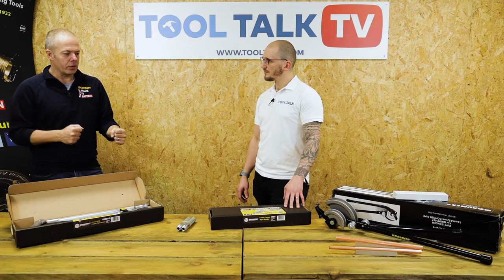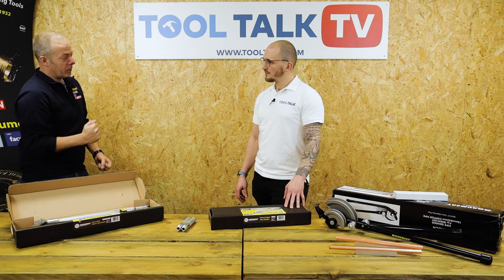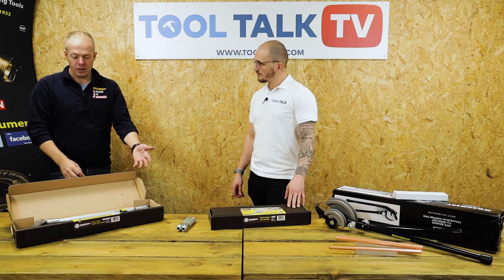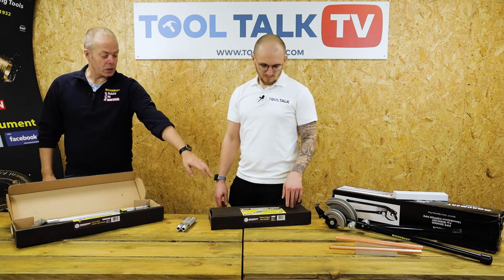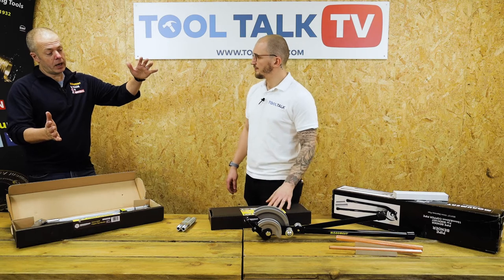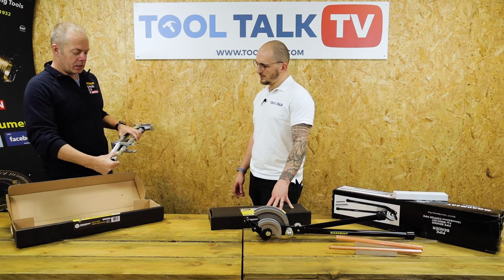When it comes to 22, you need quite a lot of oomph. One of the reasons that on a traditional combi bender and on these is you would have a rubber foot so you could put the bender on the floor and then bend it like that, because you just need that leverage — some additional leverage just to get the bend started. You can bend it without the extension handles, and I got to a point where I could comfortably do it. But some people just want a little bit of extra leverage. The extension handles are interchangeable between the 15 and the 22. We also made an extension handle for the combi — about a couple of feet long. You take the foot off and you can put an extension handle on that as well, but they're not the same as these because we manufacture this one in the UK. These are threaded and they fit and thread into the end of each of the handles.